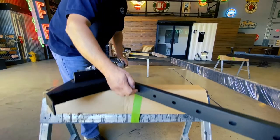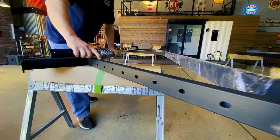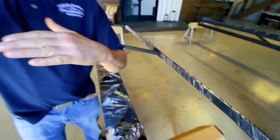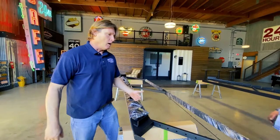He's pre-drilled everything. Drew — three inch centers? Something like that. So the code here in California, we can't have any openings in a stair rail or a railing more than four inches, so we set these at three inches. We're within code.